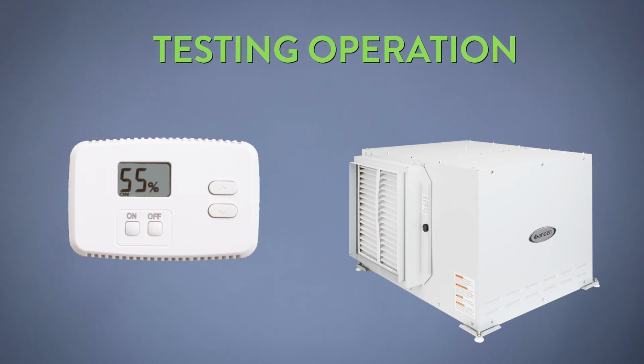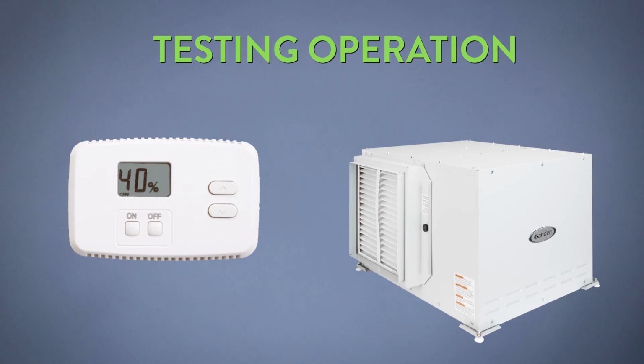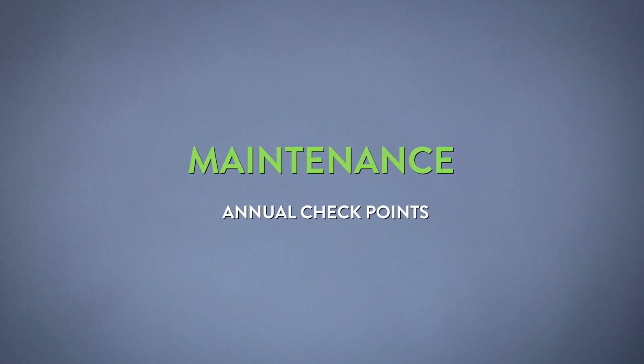Now that we have everything installed with the dehumidifier, we want to verify the operation. So we will turn power on to the dehumidifier, and we're going to set the dehumidification set point to 40%. When we set it to 40%, you'll see the word on start flashing, which means there's a call for dehumidification. And now you can go to the unit and verify that there is air moving through the unit, listen for it running, and feel the air coming out of the unit. Once we've verified operation, you'll go back to that control and set it to the desired dehumidification level, and the installation is complete.